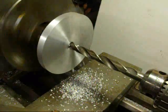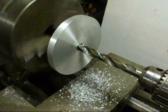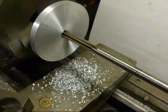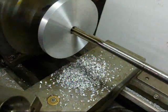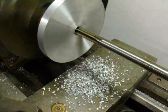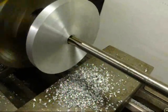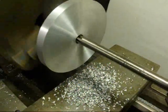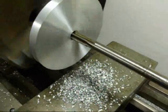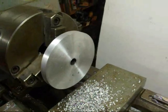I am now drilling it thirty-one sixty-fourths, which is one size under half inch. Now we've got the half inch chucking reamer and we're reaming — I put plenty of cutting fluid on there. Remember this won't take off very much; we're only taking off a sixty-fourth so there won't be a lot of shavings. And there we go — we've got a hopefully perfectly reamed hole.